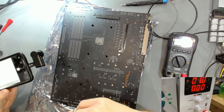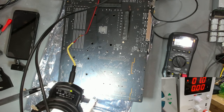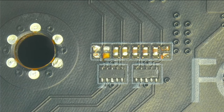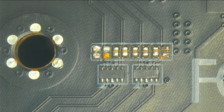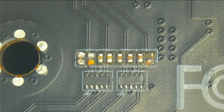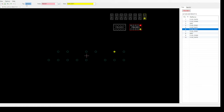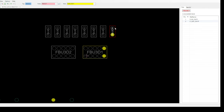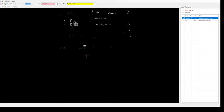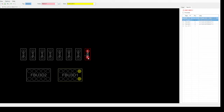The big problem is that we had high power consumption when turning on the 5VSB, which is not supposed to be like that. I can also see physical damage and I want to show you. Looking at the bottom side under the microscope - there is physical damage around this area, but I don't think it connects to anything important. It looks like it connects to a USB header. Checking the board view confirms these components connect to a front USB 3.2 header that goes directly to the PCH.